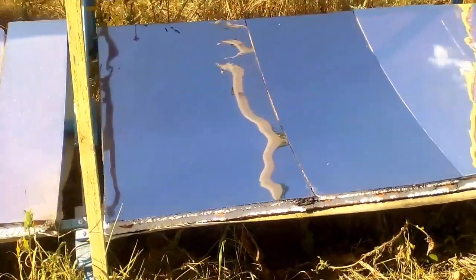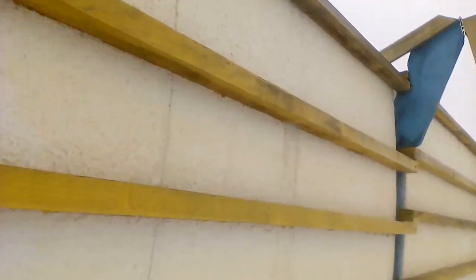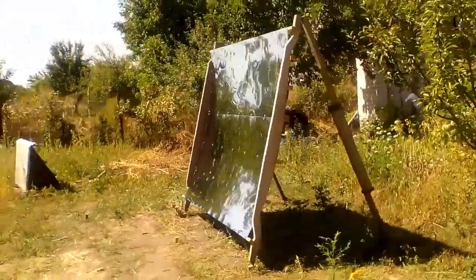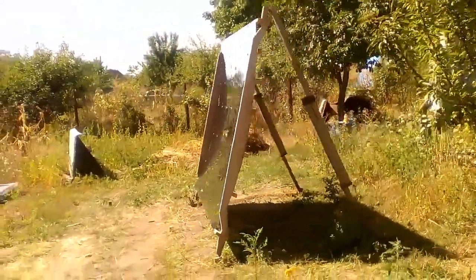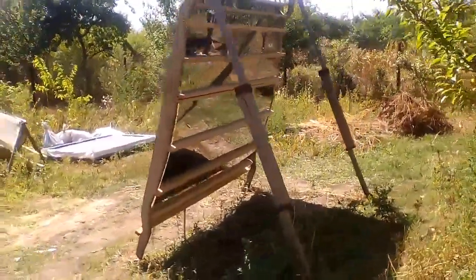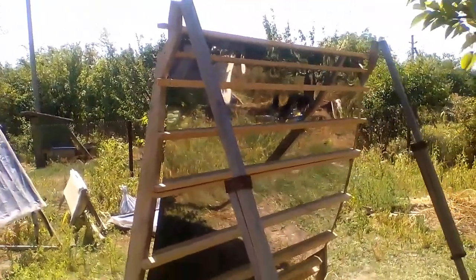The mirrors consist of a thin sheet of stainless steel, which is fixed to a sheet of expanded polystyrene. Then the mirrors are fixed on another sheet of expanded polystyrene, which has these wooden battens. There is an idea that those two polystyrene sheets between the stainless steel and the battens are redundant, but that polystyrene gives the ability to accurately focus solar radiation. This solar concentrator puts that idea into practice, and we see that the stainless sheets are fixed on the wooden battens without the polystyrene.